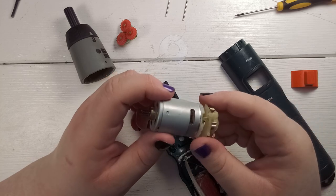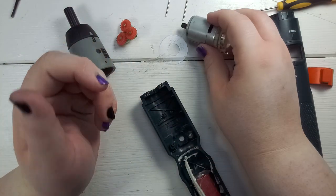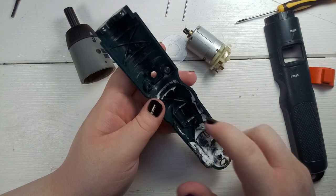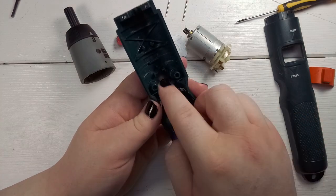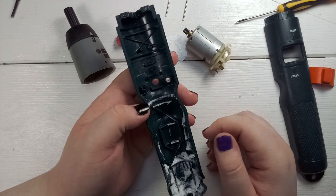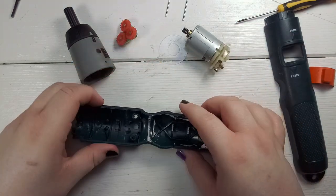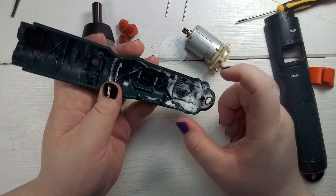And that's the motor — it's a 2.4 volt motor, nothing special about it. When I first opened it there was just the motor inside and a huge cell with one diode and a DC jack over here. This is the old charging port, so the charger would go in here and charge the big cell. The diode is just a crude reverse polarity protection, and the motor would be driven directly from this heavy cell that also has a voltage of 2.4 volts.